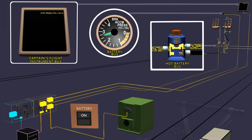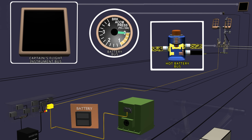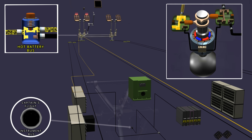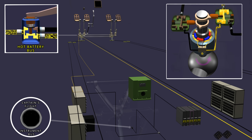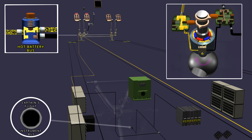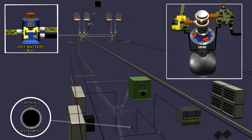The battery is a time-limited power source and will drain out quickly under full load. Therefore, when the main power is unavailable, it is important to switch off the battery. When we turn off the battery, we lose the center display, the accumulator pressure indicator, and most of the standby powered components. But the latch switch that controls the power to the parking brake valve remains powered. This allows us to set the parking brake, as the latch switch will operate to close the parking brake valve and block the anti-skid return line. But there will be no parking brake status indication as the other standby buses are not powered. Releasing the lever will open the parking brake valve. Since the power to the parking brake valve is disconnected once it reaches its commanded position, it will not drain the battery.